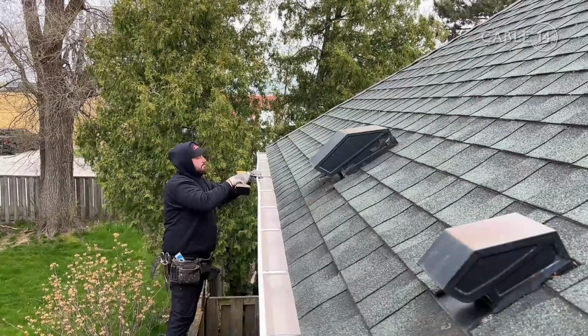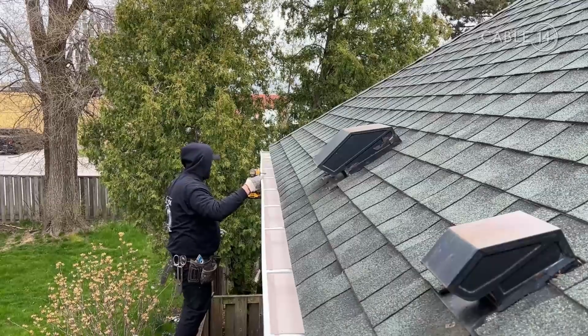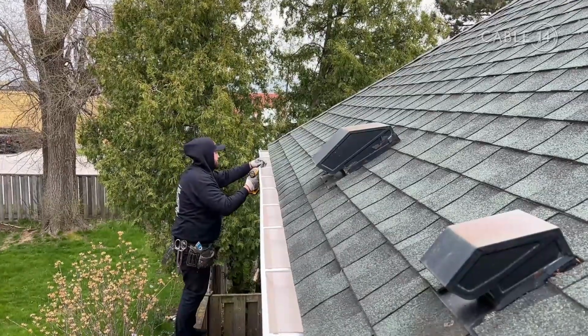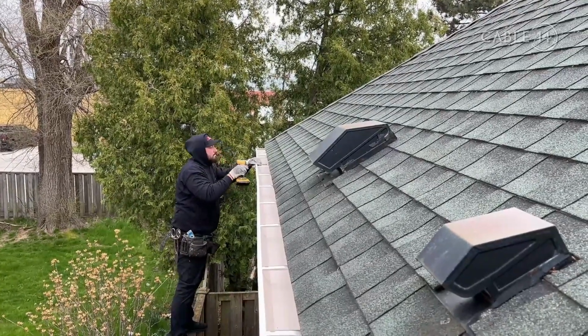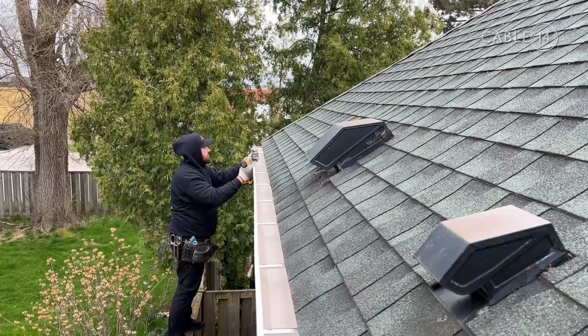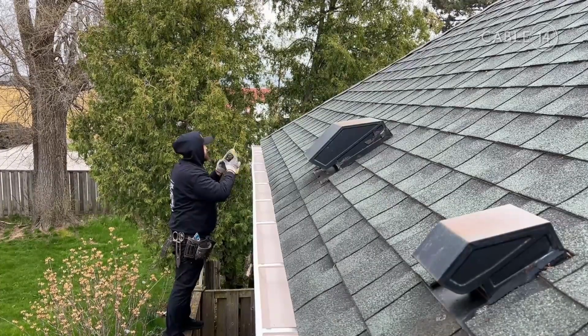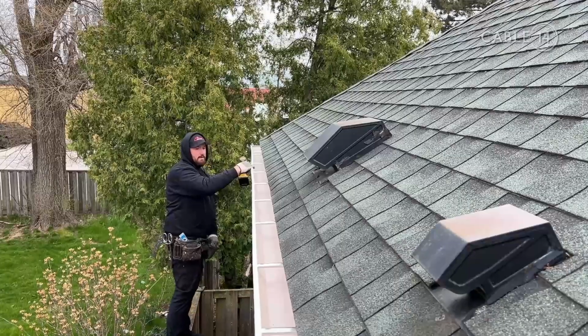And it's like a 7-inch aluminum nail with an aluminum sleeve that went inside the eaves trough. That's what gave it the tension and the strength. But it also didn't have much grip to it. Look, it's a nail. So over time, they would let go, and then once they let go out of the hole, they were pretty much done.